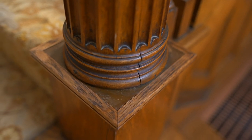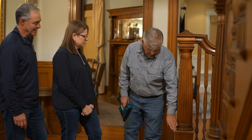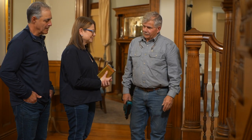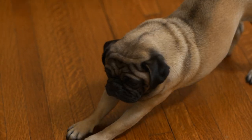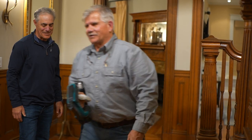Question for you — to make sure that this doesn't happen again, when can I put on the dog repellent spray? Well, first of all, I wouldn't put anything on this now because the stain is still wet and it's off-gassing a little bit, so I don't think you should chew that. I would say tomorrow or sometime this weekend, I brought you some wipe-on poly. Just put it on like you're putting on the stain with a rag. Wait about two to three hours between coats, and tomorrow you should be able to get three coats on with no problem. Then wait a couple of days before you spray it for the dog. So Rocky, you're going to be a good boy? He promises to be a good boy. Give him dog biscuits — no more oak. All right, guys, I'm going to pick up my stuff and get out of your hair. Thanks for your help. Thank you so much. Bye-bye.